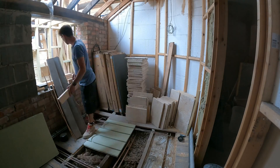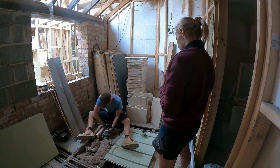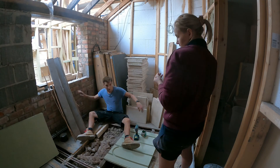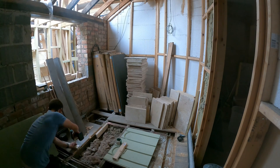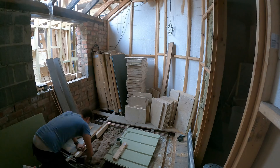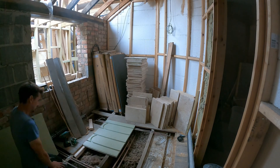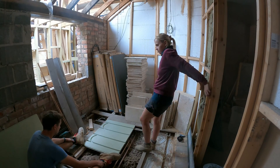When you're looking to install this — like any flooring when you're upstairs cutting out the floorboards — it's all about the prep work. You see me here just putting an extra noggin in along the timber joist because I wasn't quite comfortable with how much of the chipboard flooring was going to be sat on a very thin joist. The reason I cut it the way I did is because I had to avoid loads of nails in the original floorboarding.